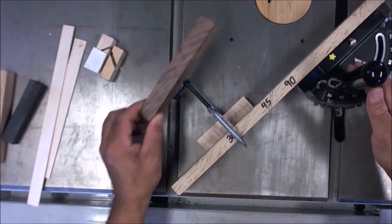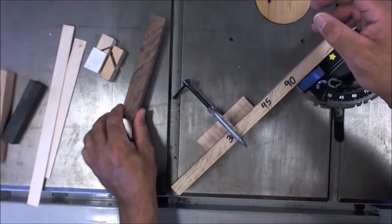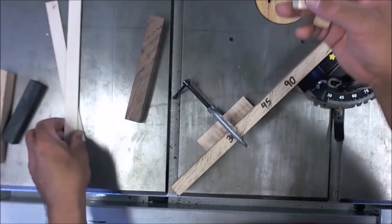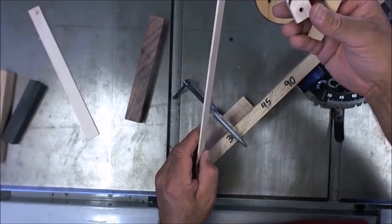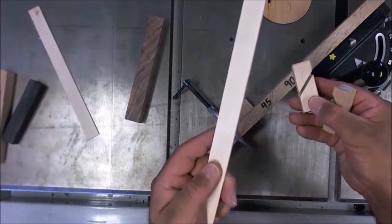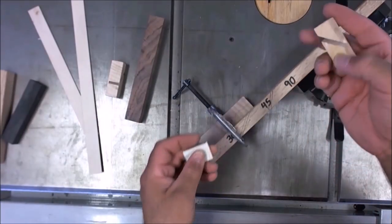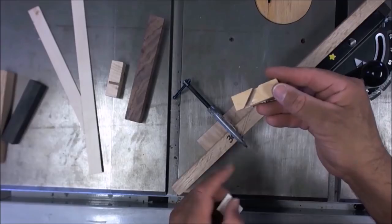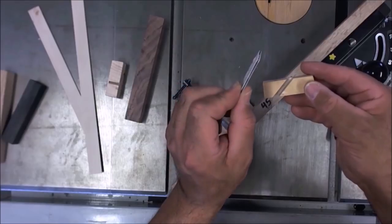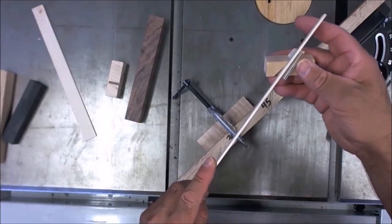Okay, on the table saw, we're getting ready to use this piece of walnut here and to do the Celtic knot. It's going to be alternating colors. As an example, here is a little jig that I use. This is a little 1/8-inch slice. These are a couple pieces of maple I've already cut up. So with this little jig, you see it's a little bit wider gap than the first one that I've shown you. And then I've taken four slices of veneer, two white and two black, because those are going to be my intersecting colors with the maple veneer.